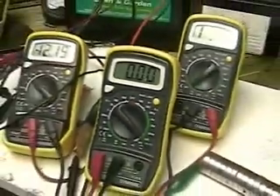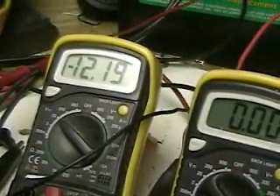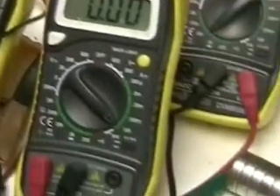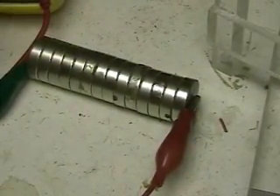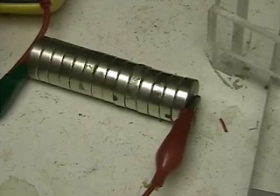What we're going to do is run a couple of experiments here. You can see the voltage at 12.9V. I'm going to hook up the charger to it so it's going to go up to around 14 volts. That really shouldn't make any difference, but I'm doing it to keep the battery steady. What I'm trying to do is narrow down all the possibilities.